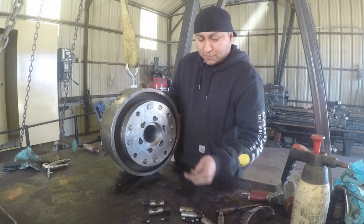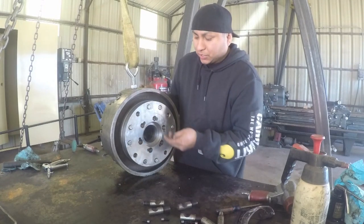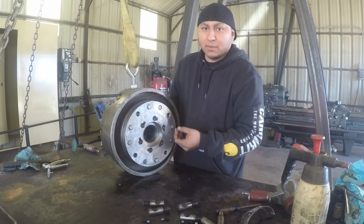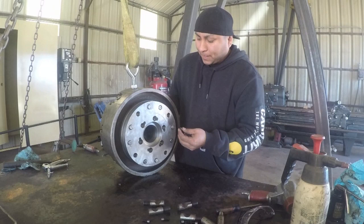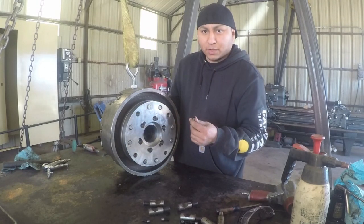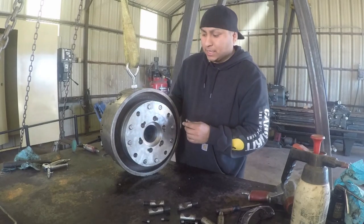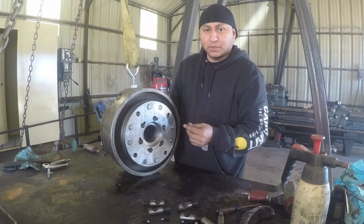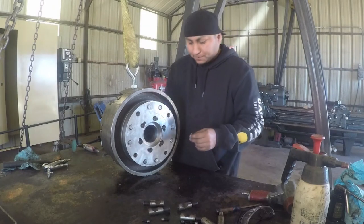Would the chuck come off? It's probably not likely to happen 6 times, but it could distort your piece. It could make it more inaccurate. It wouldn't indicate properly. So there's a host of things that could go wrong. But I found all these bolts, I think all of them except for one, were pretty much hand tight. So I'm glad that I took the time to go ahead and do this. I found a few things that needed to be touched up, and I was able to address those issues before I actually put some work on the lathe.